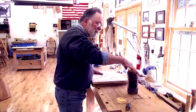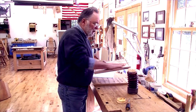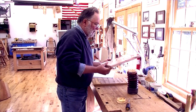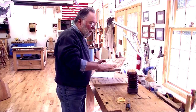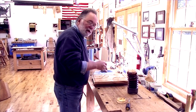Now let's just put on some of my mixture of boiled linseed oil, tung oil, and gloss polyurethane varnish. Let that soak in. We'll do 3 coats of this a day apart, and then we'll do 3 coats of tung oil, boiled linseed oil, and a little bit of beeswax mixed in. Let's let that soak in for a few minutes. Well, I'm pretty happy with the way the piece turned out, and I think my client will be too. Thanks for watching.